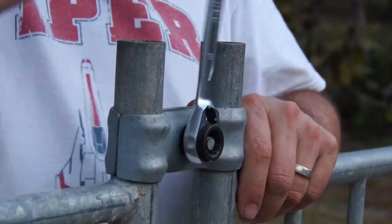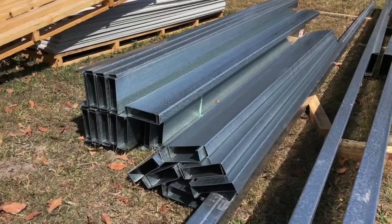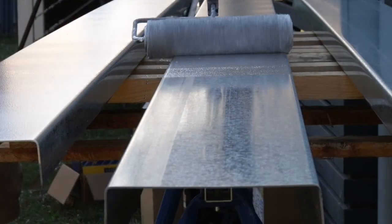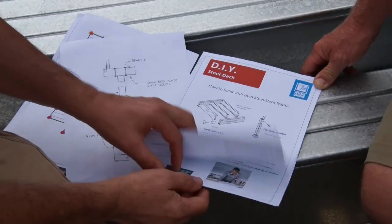The brackets also need to be really tight. Our galvanized steel deck frame comes prefabricated, and although it's galvanized, because it's beside a saltwater pool we're painting all surfaces with a heavy-duty rust-proofing paint.